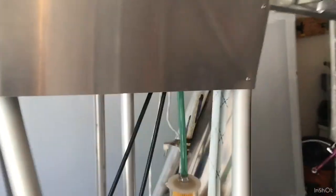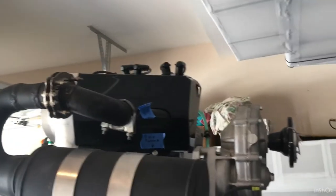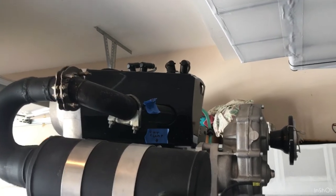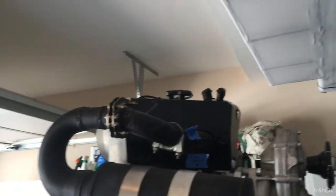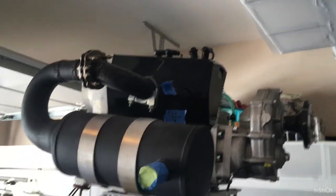Another thing I have to kind of undo from what Mike did was, talking to Matt over at Rec Power, I have to take out the spark plugs, and I have to take off the anti-seize compound he put on there, because two strokes don't get anti-seize compound either on the exhaust system or on the spark plug threads. So I've got to clean them with acetone, and hopefully the threads haven't been overstretched.